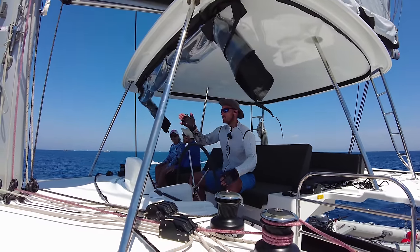Yep. So there is one control in here for the anchor, so you could use this one, but then you cannot be at the helm and use this at the same time, so you would need one person to really coordinate, which is fine, but if the crew is not so experienced, this comes very handy. This is another remote, also with a chain meter, and that's going to help you a lot, so you can have control over the boat and the anchor, but always have a person forward watching for these problems, where the chain is going, the direction of the anchor, guiding you with the hand.